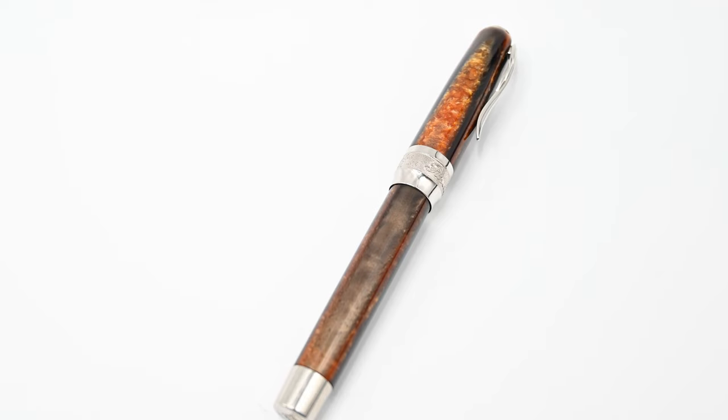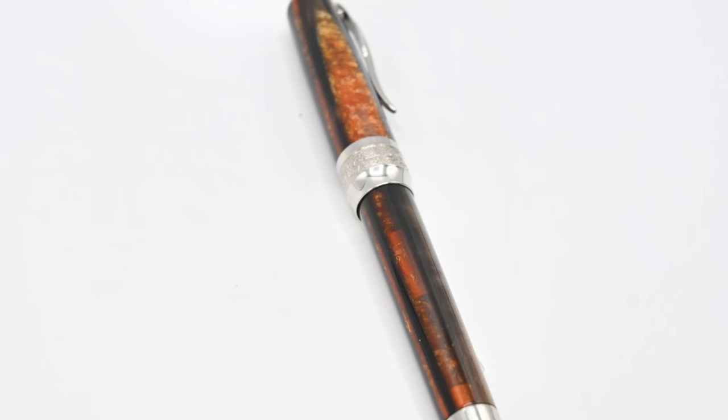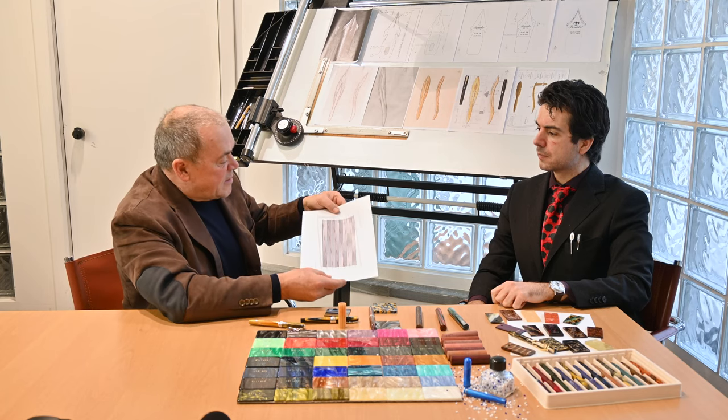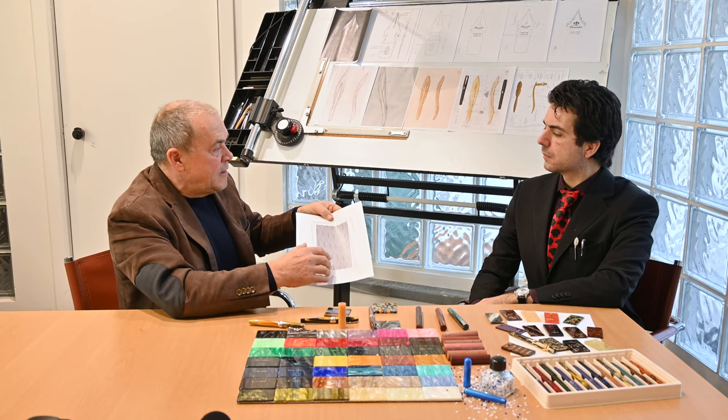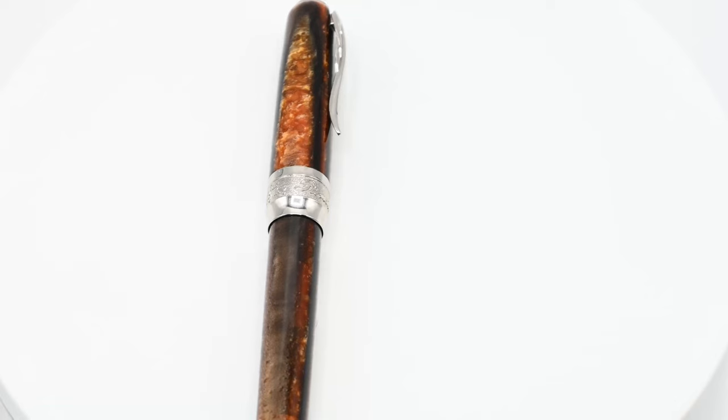So with my creativity, or expertise, I sent these schematics to the material maker to ask him to cut the material not in a straight way, but at an angle of 4 degrees. Then, when I was turning the pen, I was creating the arc effect.